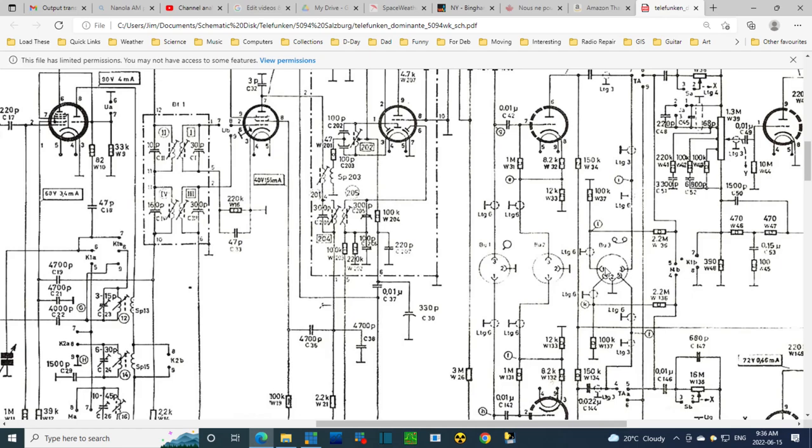to two resistors. One sure looks like orange, green. And the other one, I can't quite see here. There's a different value. I'd say brown, black, yellow, 100K. I'd say one's 100K and the other one is 2.2. Now, is there anything that matches up with that? So we come along, pick this one. There's 100K, and there's the 2.2. So that would be pin one.